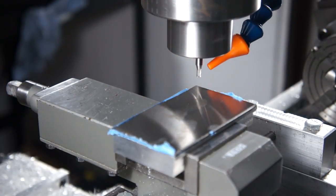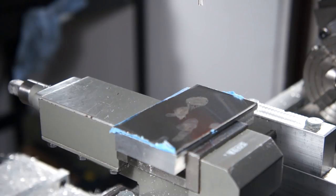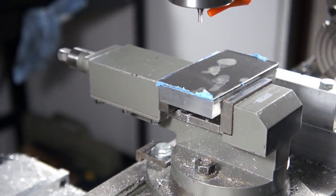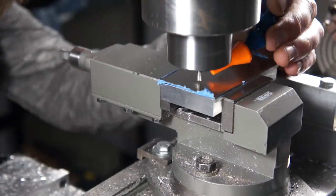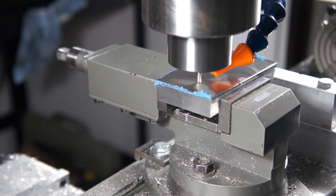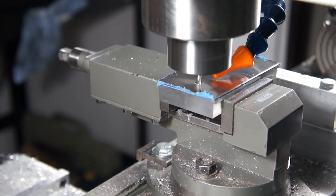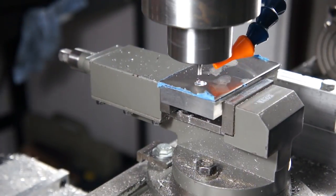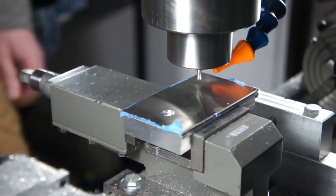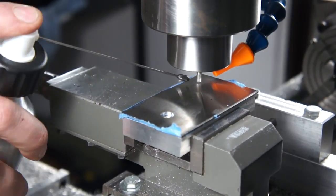Here you can't really tell on video but that end mill is wobbling horribly — these are cheap import R8 collets and they're just not up to the task for CNC milling. I choked the end mill up as far as I could and that helped a little bit, but we're going to go with a different collet system entirely going forward. The feed rate I had was like 0.0005 inches chip per tooth, which is far too small. With the runout I had, I guarantee only one or two flutes on that four-flute end mill were cutting, so I overrode it with the feed override as fast as I could.